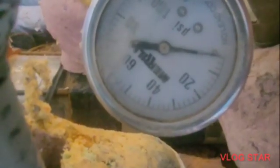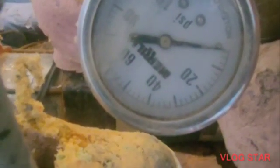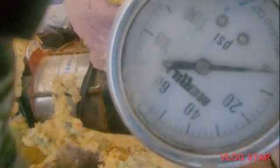Now we'll back this out, and when water comes out of here we'll let it run a little, then tighten it up to release the vapor lock. But first I'll show you what's not happening — the pressure gauge is at zero. I'm going to turn on the pump and you'll see it will not pump up. Alright, turning the pump on now.